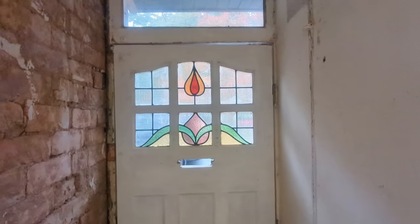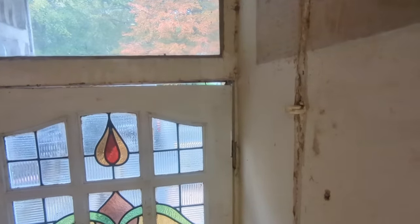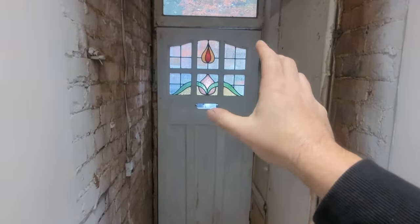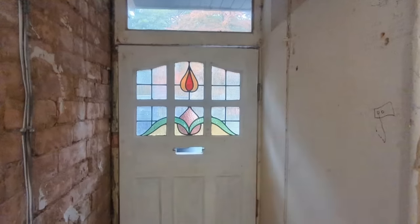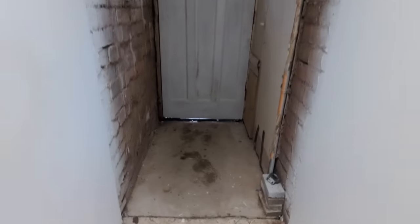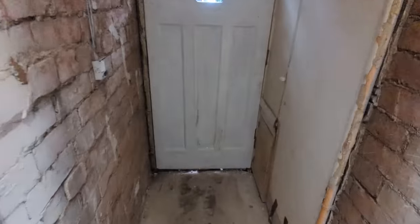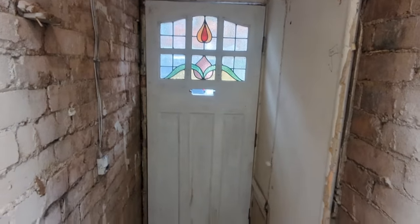This is the reclaimed door — now in the hole. There's a bit of a gap given the state of that frame, but it was always going to take some jiggery-pokery. We're thinking: instead of cutting the door down to fit the parallelogram of the frame, we might cut a bit off the old door and plant it on the top to make it fit that way. There's also a 30-mil gap on the left-hand side off the stone sill, but we can make that up and put a weather bar on the bottom — hardwood with a drip bar.